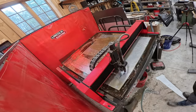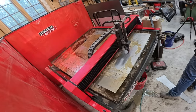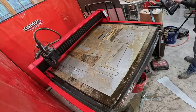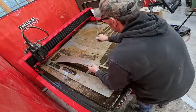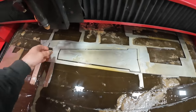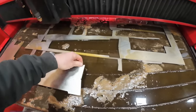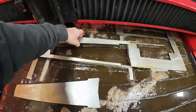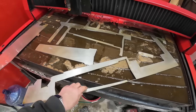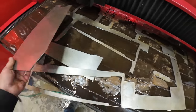Believe it or not I'm still amazed how this thing works — every time I cut I have to watch every single cut. I'm also watching for anything that might go wrong; if the machine jams I want to be there to stop it. But it's usually pretty good. Two of the legs on the shorter stool didn't make it into the cut — I must not have been paying attention and they didn't get added to the cut path. So before I move all the negative, I'm using this area as my reference location, and I cut out some scrap to use as fill.